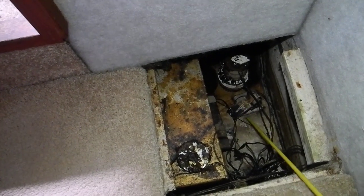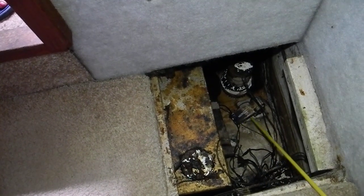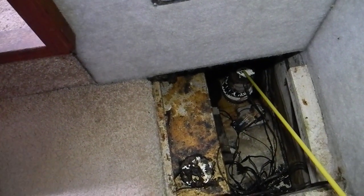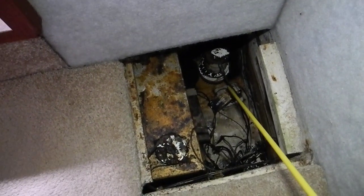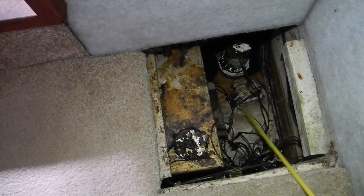See this float switch — see that line? That's the goo line. Does it work? You need to replace the float switch and/or the pump and the electrical wires. Check the electrical wires to see if they're good. This is one reason you got a lot of water up here in the forward part of the boat — the automatic float switch was not working.